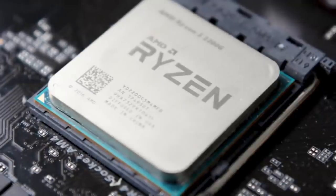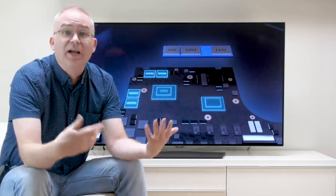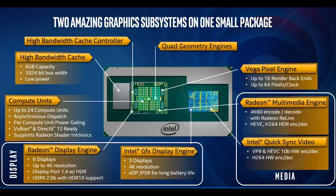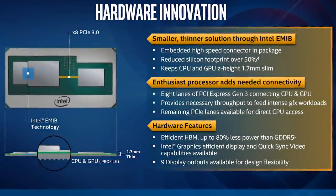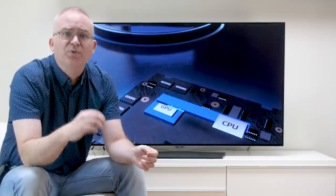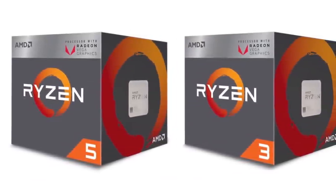There have been some comparisons between this and AMD's own APUs, which combine a quad-core Ryzen setup with their own Vega graphics implementation, but there are some profound differences. First, AMD's solution is completely integrated — everything is on one piece of silicon, so there's no need for any external interconnect. Second, Intel's solution has HBM2 memory, meaning a massive 205 gigabytes per second of memory bandwidth dedicated entirely to the GPU, while the CPU sticks with normal DDR4. On the Ryzen APU, everything is shared from the same system memory, meaning lots of contention between CPU and GPU. But the key point of differentiation is that AMD's APUs are budget, lower-power parts, while Kaby Lake G is a premium option by comparison.